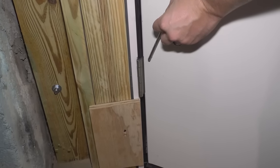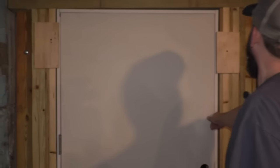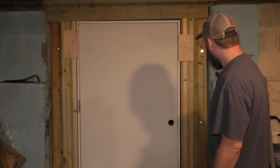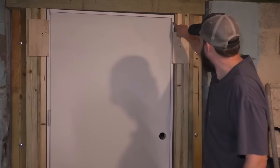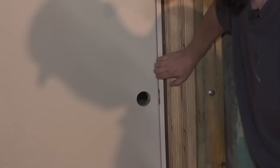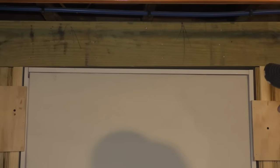We can put the door back on the hinges. I like to have my foot under here so I can adjust the door so the hinge goes in easy. Let's check it out and see how we did. That's pretty good. So what you want to look for is the reveal around the door — that gap here. You can see that it's not even, but we are going to adjust with shims and screws when we actually attach this door. I'm happy with that gap up there. It's okay that it's smaller here — I'll take care of that.